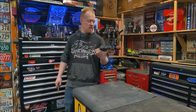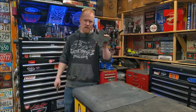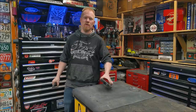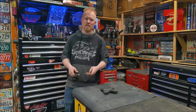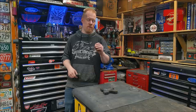I do think if you had a higher end press with better press blocks, if the press isn't so wobbly, it would work better. But also, if you have a super high end press, you probably aren't going to be worrying about little cheapo rebar broaches. And a die on the backside, I think, is a must for handling the sheer force of pushing stuff through.